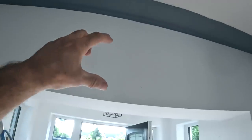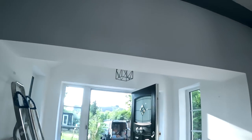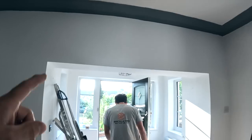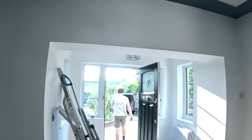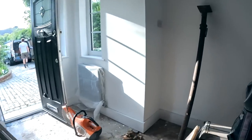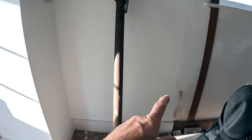putting the steel in, but lifting it up so that all this boxing can be taken out, basically so they can put a door on here. It's too low for a door at the moment. So that's the plan. And there's a bit of patching to do. This plastering is coming off, and he said this brickwork's a bit ropey there, so he wants us to patch up there. So again, we don't know what we're going to find until we start digging that plaster off.